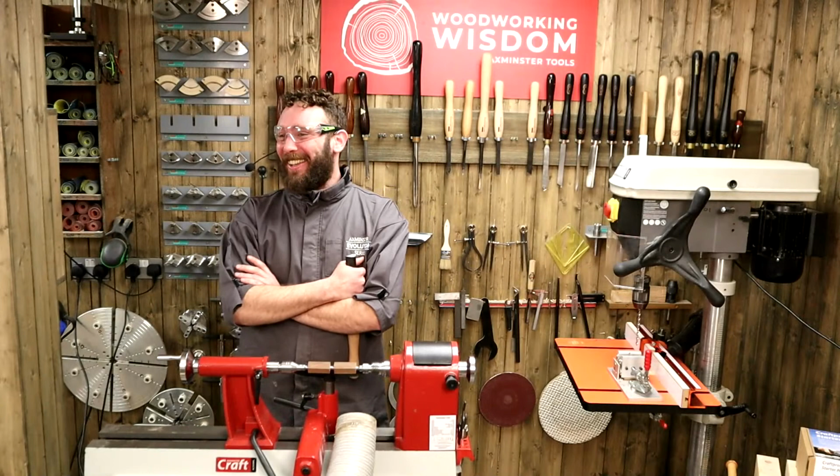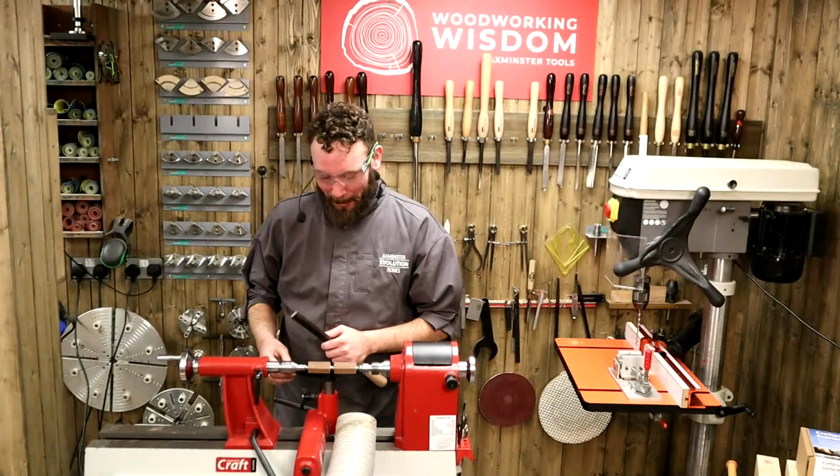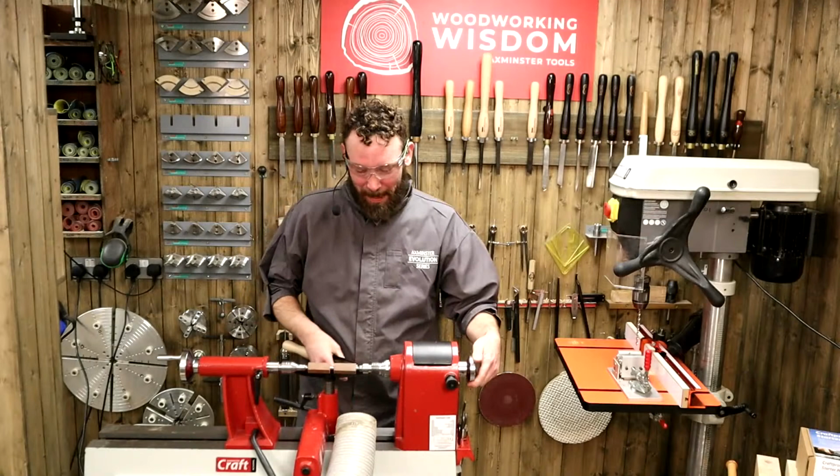On with drilling off cast iron. Yeah, drilling off cast iron is really surprisingly easy. Put yourself a pilot. What I do is center punch, so you get a little divot, really, a little point for your drill bit to start.